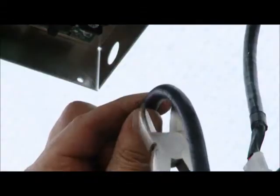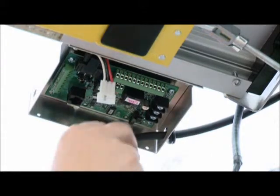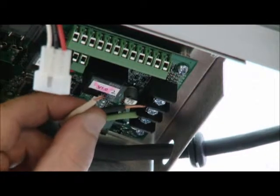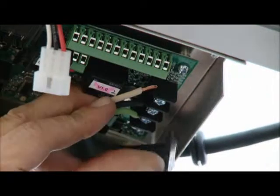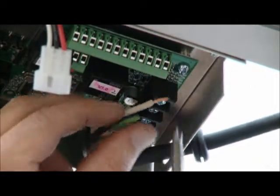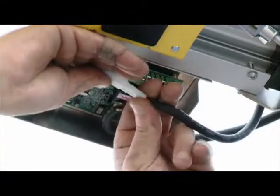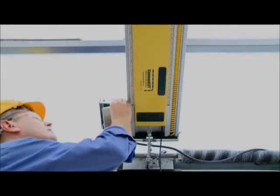Connect the 3-wire harness to the receiver box as follows. Connect the green wire to the enable terminal. Connect the white wire to the GRD or ground terminal and connect the black wire to the B+ or positive terminal on the receiver box. Make sure all the connections are secure. If the wire harness from the CommandLIFT motor unit is not connected, snap the 2 white plugs together and make sure the wires are not pinched when the receiver cover is installed.